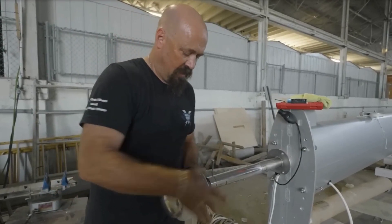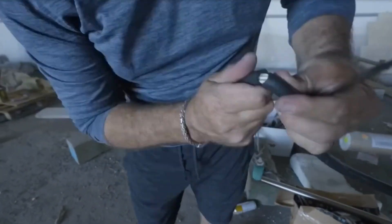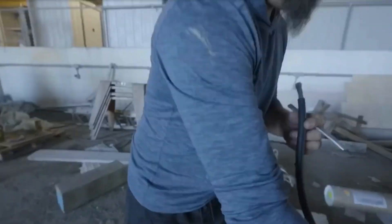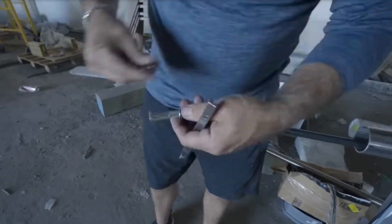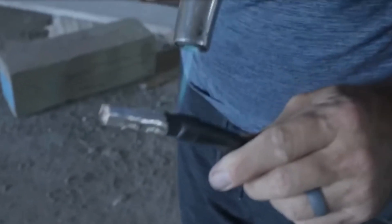After a trial fit, I'm going to strip back the large conductor that I ran down the mast. This is the grounding wire that drains all the current down to the water. From there, I'm going to add some ferrules, get it crimped down, and throw a piece of heat shrink to seal it in.